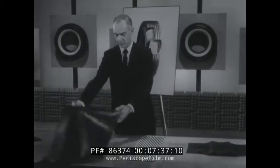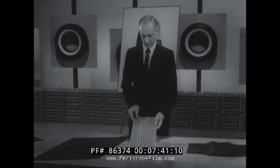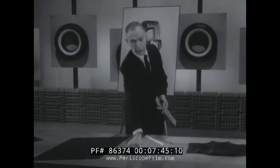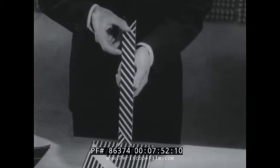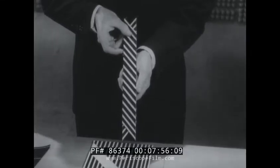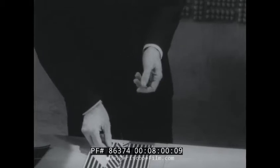This is a piece of bias-cut ply stock. By bias cutting ply material in which the cords run diagonally in one direction, and bias cutting ply material in which the cords run diagonally in the other direction, when the plies are assembled layer by layer, the cords will cross each other at an angle. This crisscrossing of the cord gives the tire maximum strength, safety, comfort, stability, and durability.